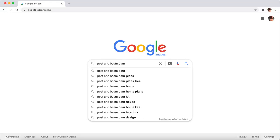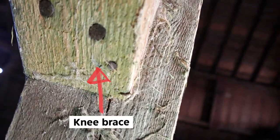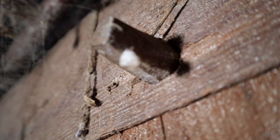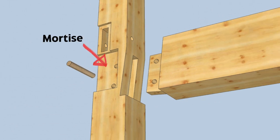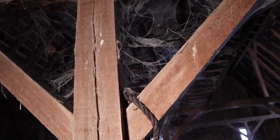This barn is part post and beam and part timber frame. A post and beam barn is when the barn doesn't have any joinery — it's all nailed together with metal machined stuff. The knee brace connected to the post and beam is nailed in. Then we're going to show you a peg that is actually part of the timber framing. The peg's job involves a tenon and a mortise that slide together. You do what's called draw boarding — on the mortise you drill the hole through, and on the tenon the hole is slightly offset so that when you drive the peg through, it pulls the tenon extremely tight, giving you a very nice tight joint.